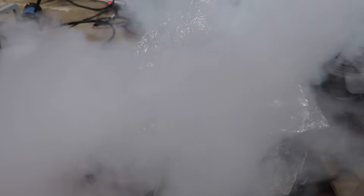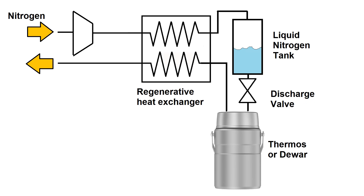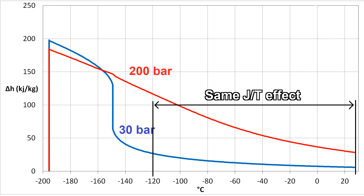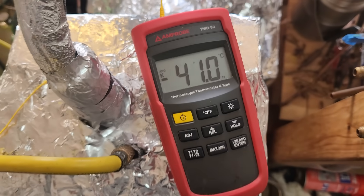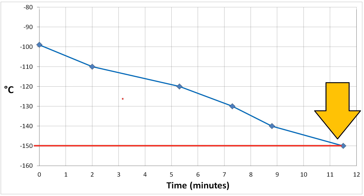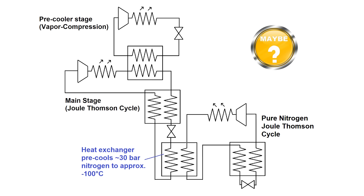After that letdown, I tried several other approaches to improve yield. Since I was losing almost all of my liquid to evaporation, I figured I should attach a sealed thermos to a regenerative heat exchanger to recover that energy and pre-cool the incoming nitrogen — but it didn't really work out. I also tried reconfiguring my cryocooler as a pre-cooler for a pure nitrogen Joule-Thompson cycle: if I pre-cooled a 30-bar nitrogen stream to around minus 100°C, it would be thermodynamically equivalent to a Joule-Thompson cycle at 300 bar at room temperature. I built yet another counterflow heat exchanger for this, and that didn't work out either. There was one promising attempt with a really tiny counterflow heat exchanger inside a thermos — I got down to minus 150°C with pure nitrogen pre-cooled to minus 75°C, and it seemed to be dropping further, but then I killed the nitrogen compressor from overheating.